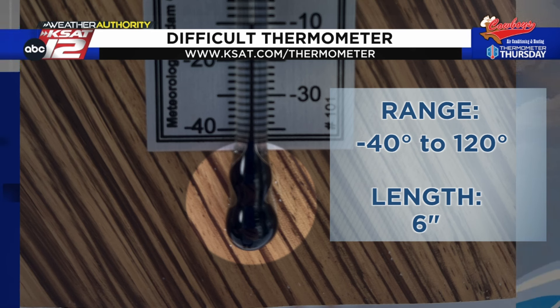My success rate with these thermometers is only about 50%. As I make them, fill them up, and start calibrating, I realize — nope, this one won't go cold enough, it bottoms out in the bulb. This one won't go warm enough to cover it all. So that's just one of the challenges I run into when I try to make these for different climates.